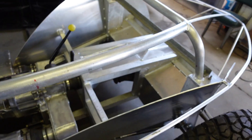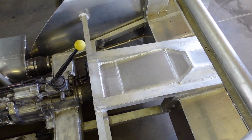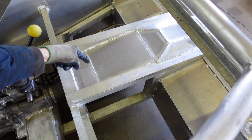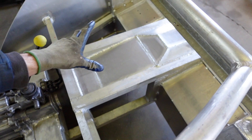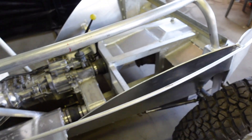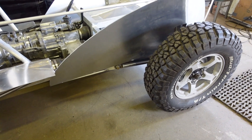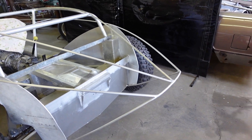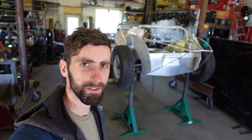Got to be pretty open in the center — I welded all that in but now I have to cut it out. The plan is now to have this piece removable, this little square here, so I can access the drive shaft and the front of the differential, and unbolt the differential and take it out through here. I was going to do all this through a removable panel on the bottom, but I think it'll be a lot easier from the top. That way I don't compromise the rigidity of the bottom of the boat — I'd like to have a nice smooth bottom.